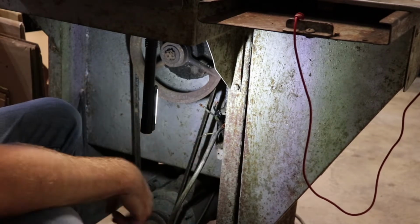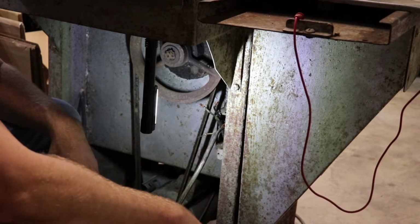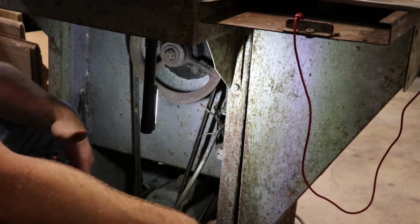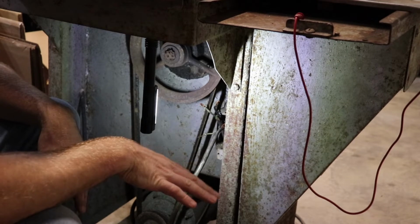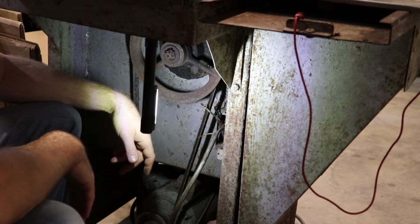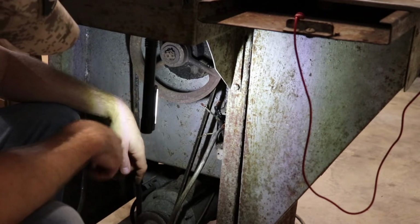I'm going to go ahead and switch out the entire plug because that one is falling apart, it's corroded, the insulation is cracked. So I'm just going to eliminate that and then wire everything properly according to what's going on up here. Hopefully that's what fixes it and then we'll be good to go.